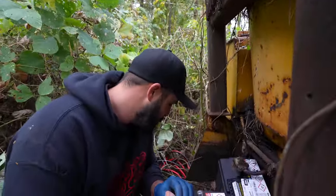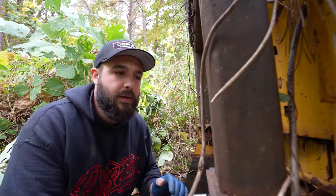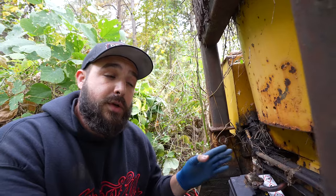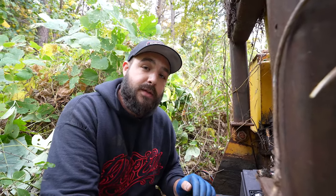So what we're doing back here — I don't know if this is 24 volt. I know some old equipment was 24 volt, and I guess most new equipment is 24 volt too. We're going to check and see if it's 24 volt, because it seems like either there's not enough juice going to that starter to turn it over or it's just bad. So we're going to try 24 volt and see if we fry something.